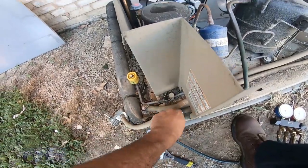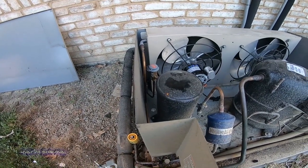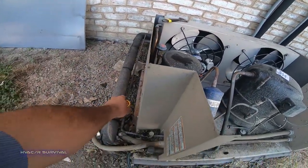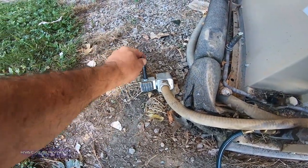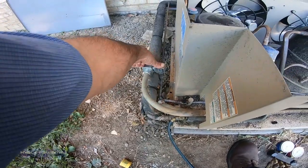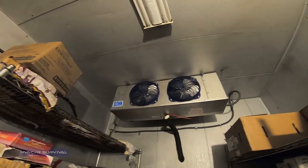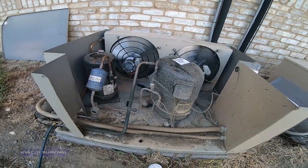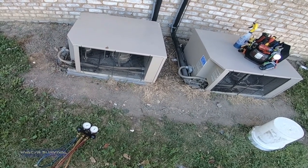Looking at that headmaster — it's set for 180 psi. This is a brand new unit, and the one we did yesterday was also 180, but the paperwork shows R-404A should be running around 210, which would be above the 90-degree liquid line. I also put a piece of metal in the coil circuit — in case you forget you've unhooked something, it keeps you from burning out your coil. I can hear the refrigerant pumping through. The fan delay termination switch needs to make contact yet, and as soon as it does the fans will kick on. We're at about 32–33 degrees — fans are actually working. Looking good.